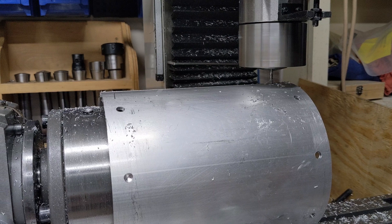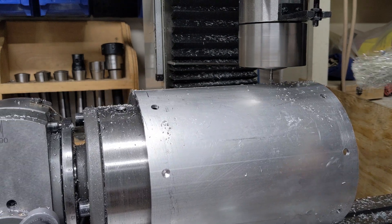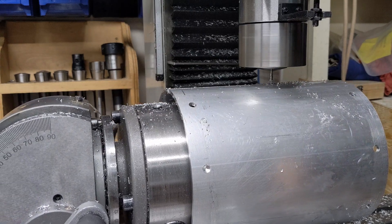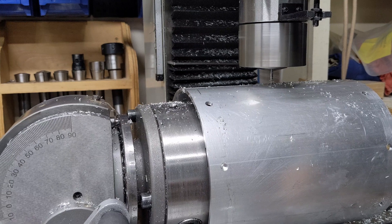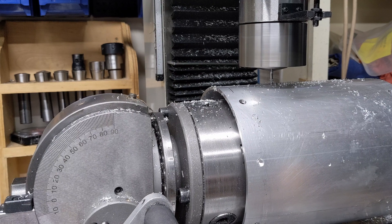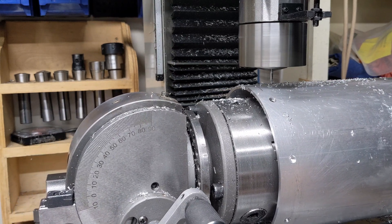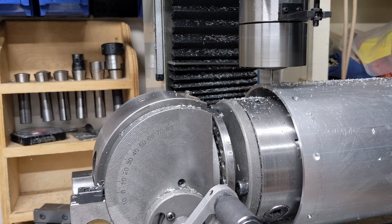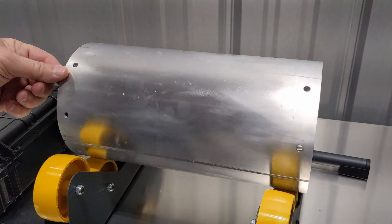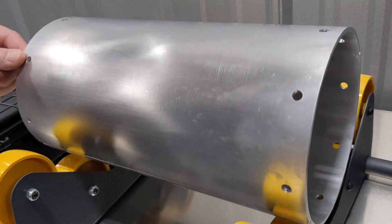Since this is a clamshell part I'm going to go ahead and mill a slot all the way across with this 1/8-inch end mill. I make sure to leave just a bit so that the two parts are actually connected, but I can cut them off with a hacksaw and file it down. And there we have it — nice and square. You can make this on something as simple as a mini mill as long as you have the right tools and fixturing.